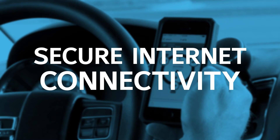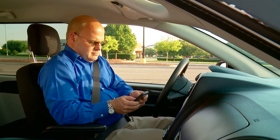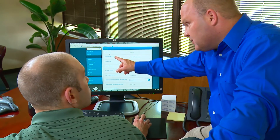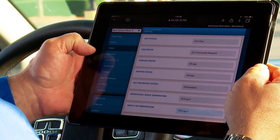Finally, at the networking level, the MAP device enables remote communications from anywhere. Using an Ethernet connection, it creates a gateway that enables secure internet connectivity for remote access. With remote monitoring and control, all that legwork and guesswork about unit status and performance is eliminated. That makes it easy to access energy tracking and monitoring capabilities to ensure the entire HVAC system is performing at its peak. Facility managers, technicians, and building owners can view critical parameters and change set points using any convenient device with a web browser.